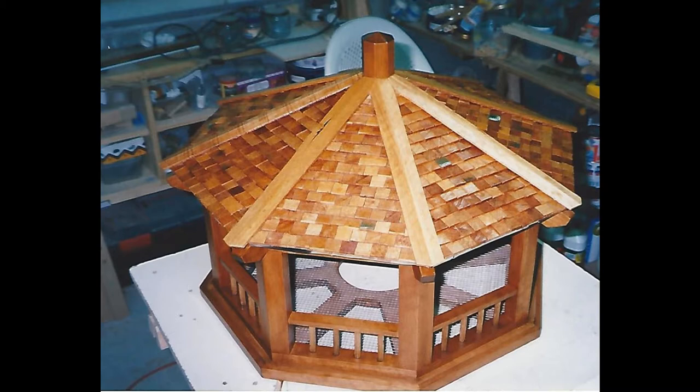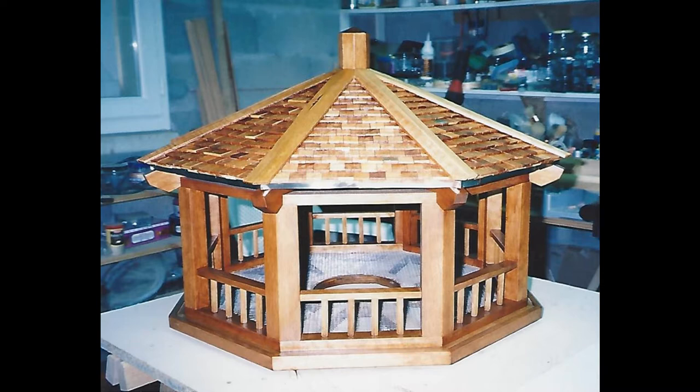So you'll see in the backyard, I made a sonotube and poured some concrete. In that post, I put two nutted bolts, so it would go into the concrete and not move. And on each flap of the post, I put an angle bracket so that it would conform to four of the spokes in the flooring, and screwed it from underneath, and it was just solid. It made a good base, and it was a nice height for easy access, out of the way in the backyard by the flowers, and it looked really well.